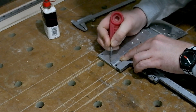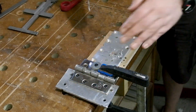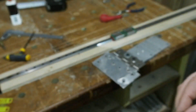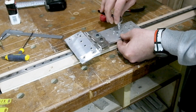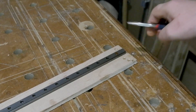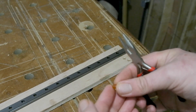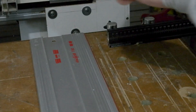Just ripping off the tracks here so I can reuse the ply to mount the new linear rail. My linear rail is the fairly small 12mm type. The bearing blocks take tiny M3 screws and, having no play, benefit from some careful layout — four at 20x20mm centres. I have hex head M3 Allen screws but the heads, accepting only a 2mm Allen, round off way too easily. I use M3 bolts instead so I can apply a little more torque. I've added a nut under the head as a spacer in the absence of appropriate length bolts. If you buy any of these linear rails they'll likely come with little plastic stops — don't throw them away. They serve as easy on-and-off end stops and save your blocks coming off and losing the tiny bearings all over the floor. I'll be using them as stops top and bottom.